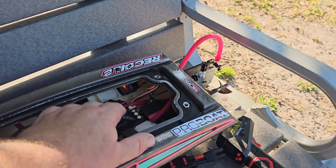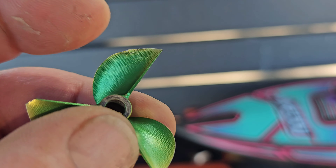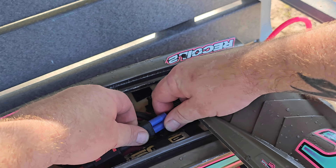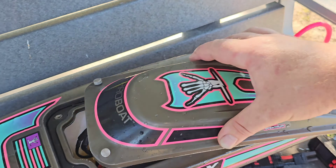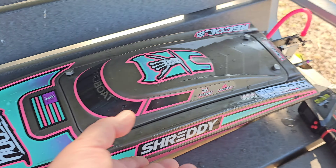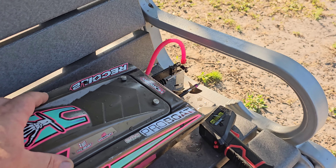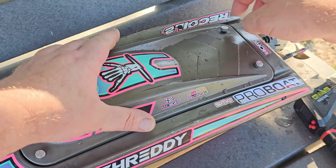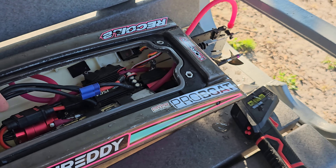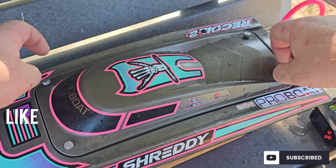Dang, that is awesome. That's what I was getting with this Oxstein prop. Look, I dinged it up right there — during transport, it flew off the back seat in the truck and hit the tailgate and dinged up that prop, which you cannot get anymore. So, 47 and 64 — not bad. I actually need to add a secondary cooling pickup. Probably going to use an Oxstein transom mount because I've got all this run on one pickup, so it's about time to add a second one. We'll do that here shortly. Thanks for watching — we'll see you guys next time.